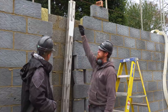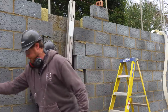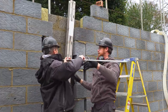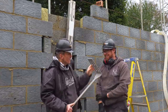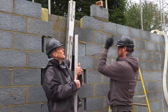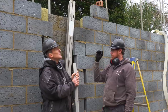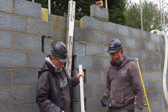We also need to know the height of the underside of our first floor joists, because once they're in we've got this big piece here that bolts on at that point — they've measured the holes there, and that straps right across. We've actually gone slightly higher than the underside of the joist because we didn't want this interfering with plasterboard or having to cut around it. So we've gone just a little bit higher and we're going to run noggins all the way through to take up all of these fixings — and there are a lot of fixings there.